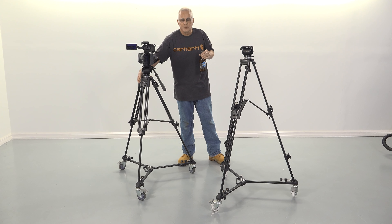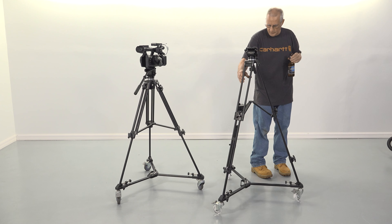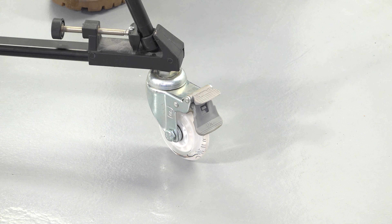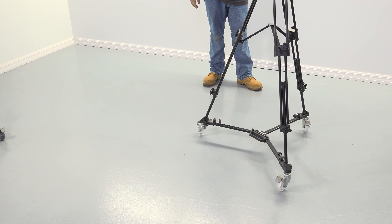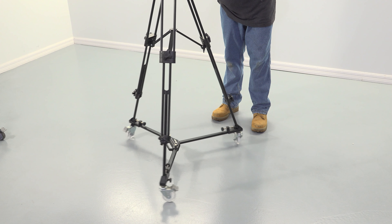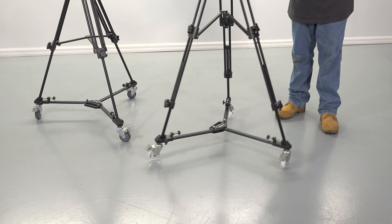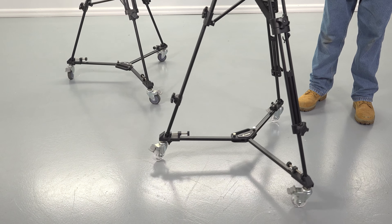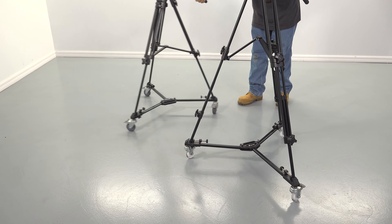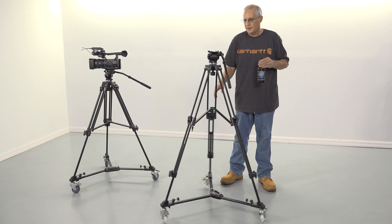Now for the test. Did it work? Here's what we had — and here's what we have now. The brakes work just like they did. The nice thing is, this is super smooth to spin around and pivot and get cinematic shots. The wheels all lock and put it in place. That is super smooth, super quiet no matter where you go with it. We used 80mm with a 76A hardness, so they're very soft and very smooth — compared to the original commercial casters that are making a lot of noise and don't move very well. I think that pretty much speaks for itself.